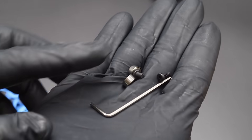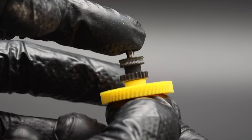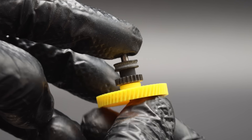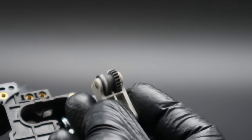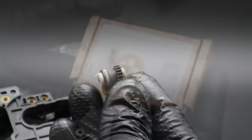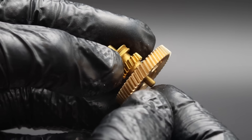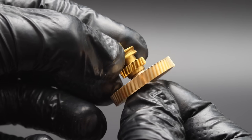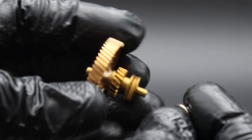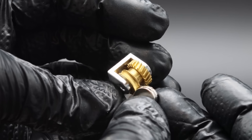The extruder housing comes with two new bearings and some allen keys. The stock setup has the large nylon gear attached to hardened steel gears — a helical cut large gear driving a straight cut hardened steel gear, with the driven gear on the arm combining a straight cut and finer hobbed extruder gear pinned on the arm. The upgrade is called the Panda Claw. The large helical gear is machined from brass — heavier but stiffer — while the other gears are hardened steel with an RNC nano coating for better wear resistance.